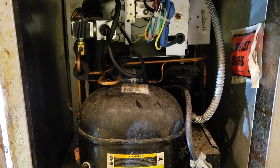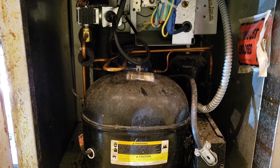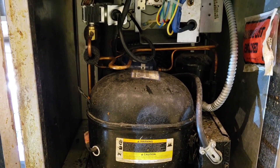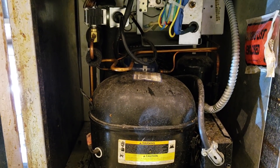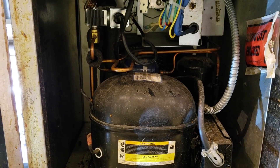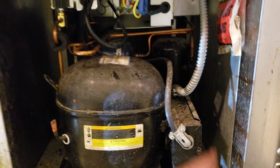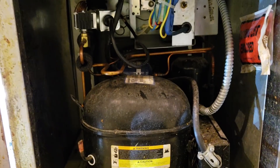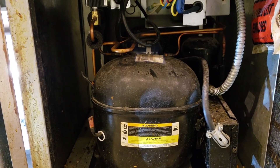I amped out the glycol pump - it was running at 0.9 amps - and my thought was that it was working. So my next thought was maybe the evaporator froze up, because I have seen that before. I unplugged the compressor and let the glycol pump run for a little while to try to defrost the evaporator if it was frozen up.